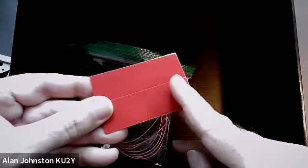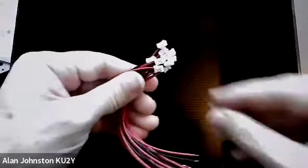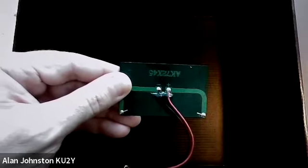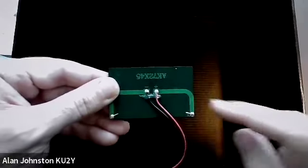This is the double-stick tape. You'll need scissors to cut little pieces of it and use that to fix the solar panels onto the frame. Finally, there are 10 JST2 connectors — each one gets soldered onto a solar panel. The red wire goes to the positive and the black to the negative. When done, the solar panels will look like this, with red soldered to plus and black to minus. You can optionally use hot glue or another adhesive for strain relief, but if you build it right away without disassembling it multiple times, it should be fine.